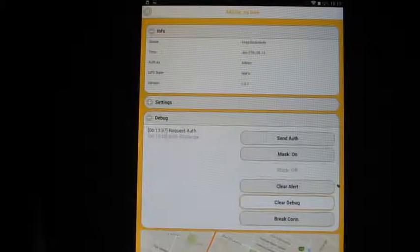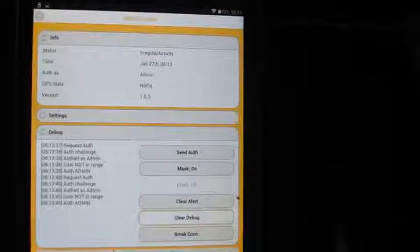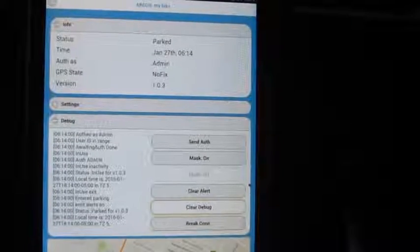The device has been moved and we're still connected, but outside the authorized use zone. The app does respond to the incoming re-authentication requests, but these are ignored by the module, as it is near impossible that the user is actually the one causing the disturbance. As we get closer to the module, the device detects our proximity, and on the next re-auth request, our response is accepted as valid, and the device relaxes back into parked mode.